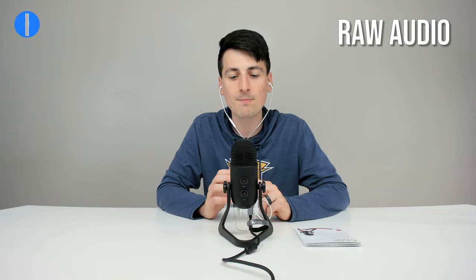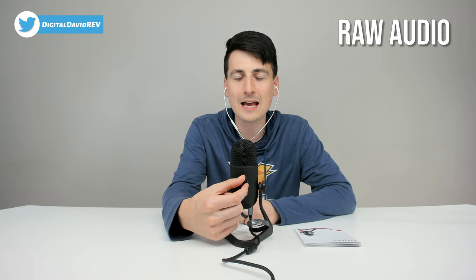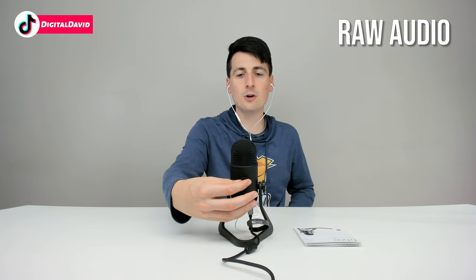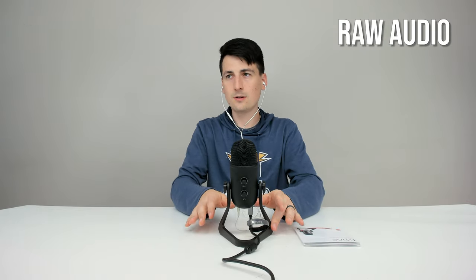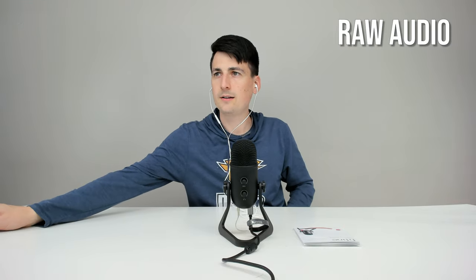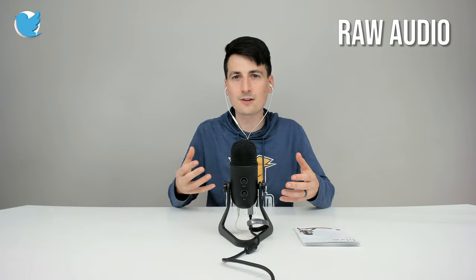We're about six to eight inches away from the microphone so you can hear how it's capturing my sound. We have the gain currently set to zero. We can tweak it right here and start adjusting — twisting the knob to increase sensitivity. But we'll need to step back a bit because it's very, very sensitive. With the gain up more, it's picking up a lot of extra detail: touching surfaces, the creaking of my chair, mouse clicks. So it's picking up a lot of extra background noise.